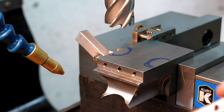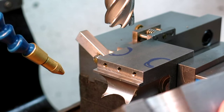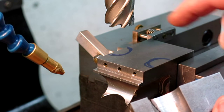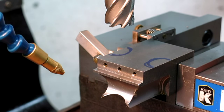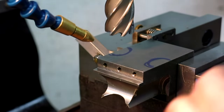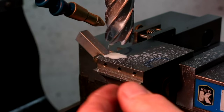Let's knock these two holes in first, and then we'll move on to cutting this radius and this one. This one gets a concave and this one's convex. I've got to make sure I mark the ends — fixed jaw, moving jaw. You've got to be careful at this point because they're going to separate very soon into their constituent jaws and you don't want to make a mistake.